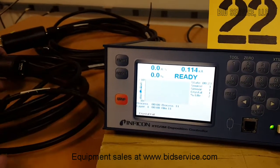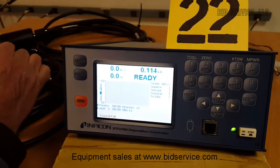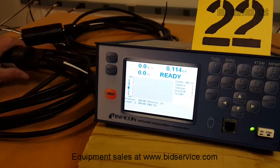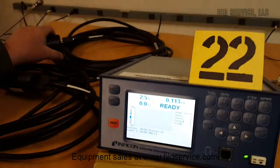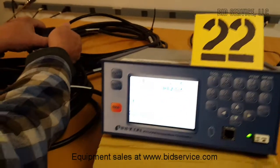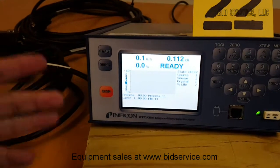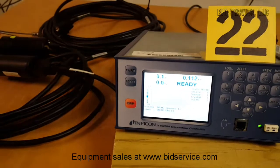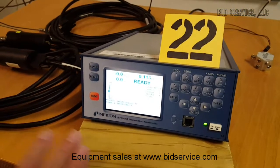As you can see, we get a response and a crystal failure on this one. I'll reconnect it and it will again recognize that the crystal is good and return to normal operation. Just to show that it is differentiating between the two, I'll disconnect Crystal 2 — and since we're not connected to Crystal 2, it's not going to fail. So it is reading each one separately. There are two sensors on the back — that's how it determines this.